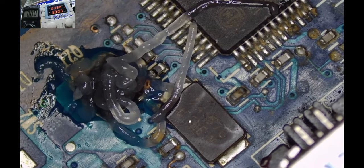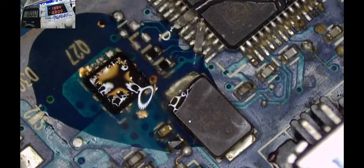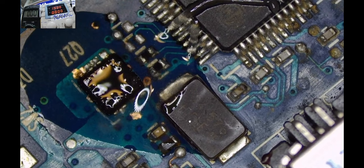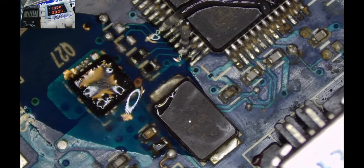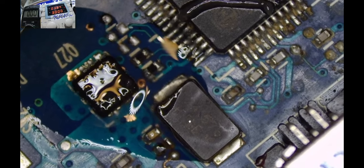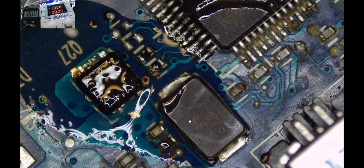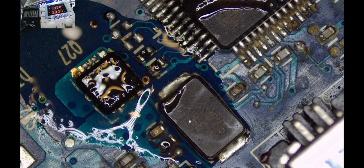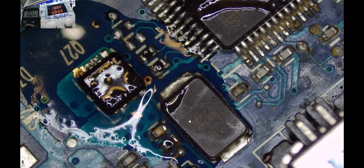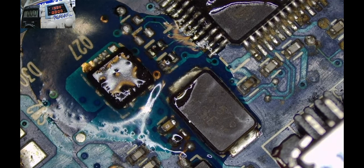Yeah, so as I was telling you before, you see? Now this is one of our Augie guys who has been pestered by these cockroaches until he has decided to give up in life. So guys, we'll take out this MOSFET and try to see whether we're still having more short. And I've tried to drive away the cockroaches. I've tried to give them some pesticide here, the isopropyl alcohol I use, which is very effective at killing roaches, so it still can work fine.